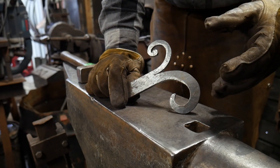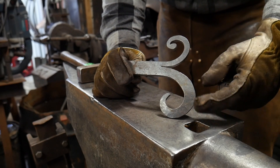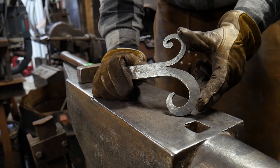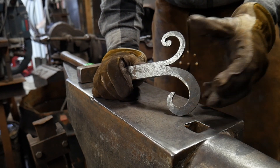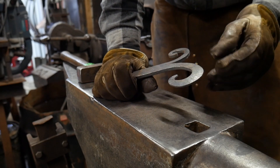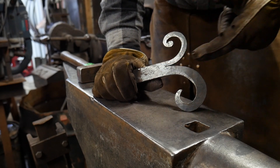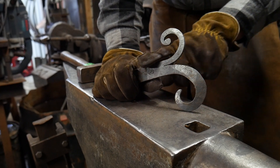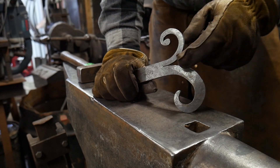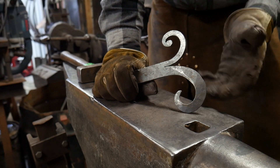But I would like to remind you that this is an end detail. There will be no nails, screws, or otherwise load-bearing elements on this portion of the scroll or hinge. You'll see commonly in old ironwork where there's an area like this — where they've layered two different pieces and forge-welded them together — and you'll see where the cold shut or the end of the toe or scarf did not weld in.